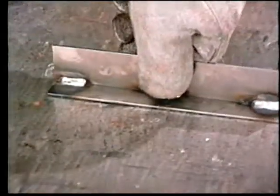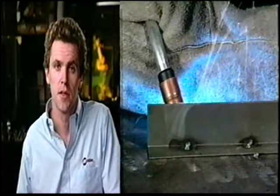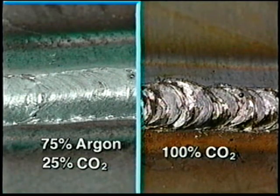This is an example of a good weld bead — the machine settings and travel speed were correct. After you've gained some experience, you'll be able to tell when the settings are correct by listening to the sound of the arc; it should be a smooth, unbroken sound. To ensure good electrical contact at the welding gun, be sure that you change the contact tube based on the wire diameter that you're using. As far as shielding gas, you can use either carbon dioxide or a mixture of 75% argon and 25% carbon dioxide. Carbon dioxide costs less and will produce a deeper penetrating weld. The 75-25 mixture produces a smoother, less penetrating weld. If you're having trouble with burning through when you're welding on thin material, try using a mixed gas.